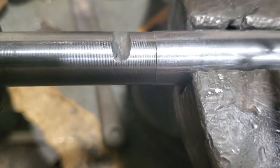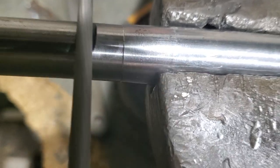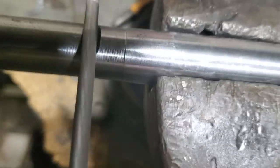I torqued it down to something, it fit the handguard things, and the hole for the retainer was too far forward because of everything wrong, so I took the chainsaw file to it until it fit. Installed the gas block, made a mark, removed the gas block, drilled a 1/16th inch gas port, and then reinstalled the gas block and the pins, and we're good to go. Only thing left to do is test fire.